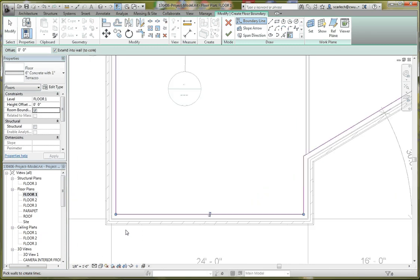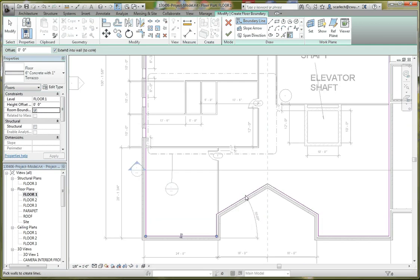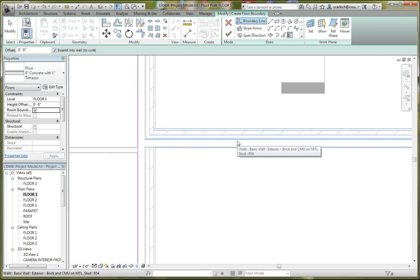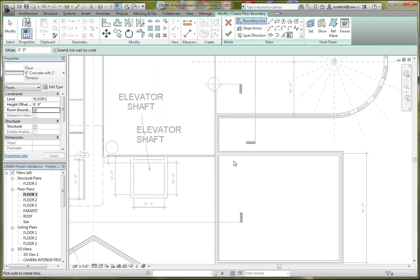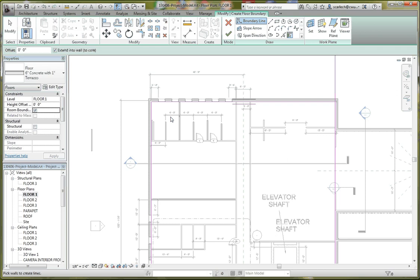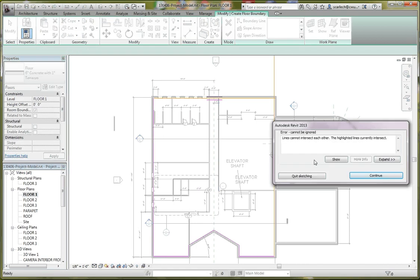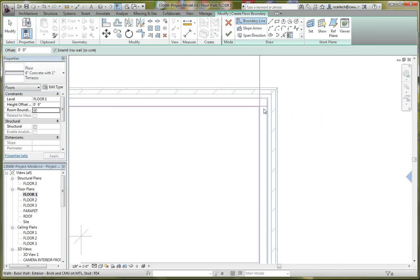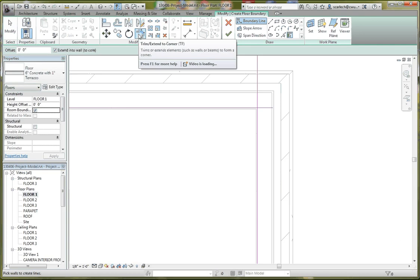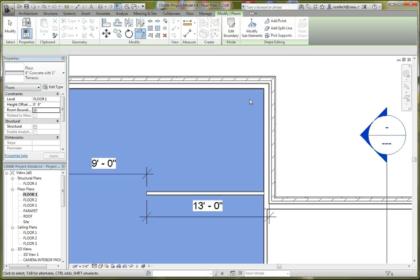Click on the exterior portion of all these walls as you go around the model, following a clockwise format. You can quickly go around and select these — it's only going to select elements on the exterior of the core, so you really only have two choices. If you zoom in, you can see the exterior core and the interior core. Once you've gone around all your walls, get ready for the green check mark. There are two lines extending beyond the boundary, so we go to the Modify tab, use Trim/Extend to Corner, select the elements we want to keep, and then click the green check mark.